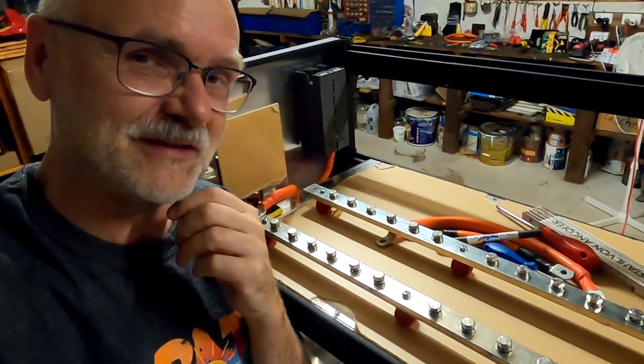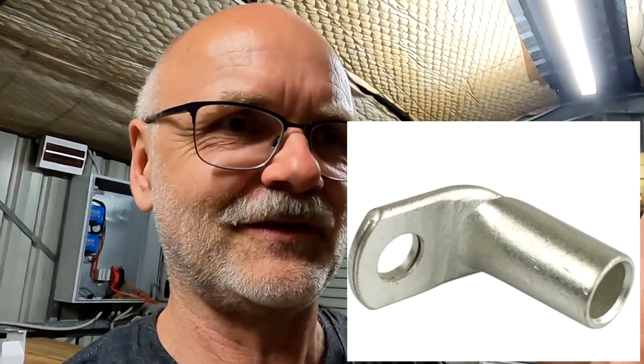Sometimes I'm reading really good comments — for example, PowerPole, the aluminium bus bar guy, suggested that to keep cables better organized I could have used bent cable lugs. We've all seen those — they either go backward or forward, 90 degrees or 45 degrees. But this one is different because it's bent sidewards, called a left-bend or right-bend, or elbow bend.